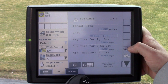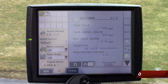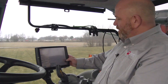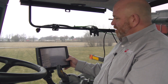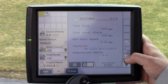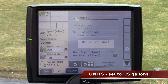Hit the back key and advance to window 2 of 4. Make sure your tank size is correct and you have zero speed in the min auto speed field. Another item that gets guys once in a while is the units showing liters or some other value instead of gallons — that is not controlled by the display. All other values and language are controlled by the display and need to be changed within your Pro 700, Intelliview, or other display by referring to your owner's manual. If it says liters here, hit the weights and measures soft key and ensure it says US gallons.